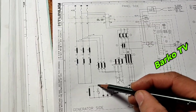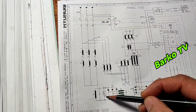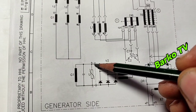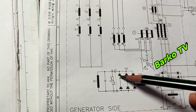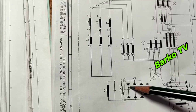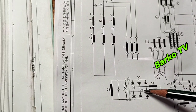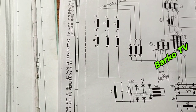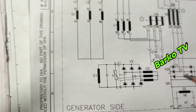This is the schematic for the rotor exciter system. This is the varistor — just connect a jumper using an alligator clip. But if you use an alligator clip, just scratch the terminals so there is contact on it. Note that the nuts or securing bolts may have a coating on them. There are five points — you need to short all diodes and varistor.